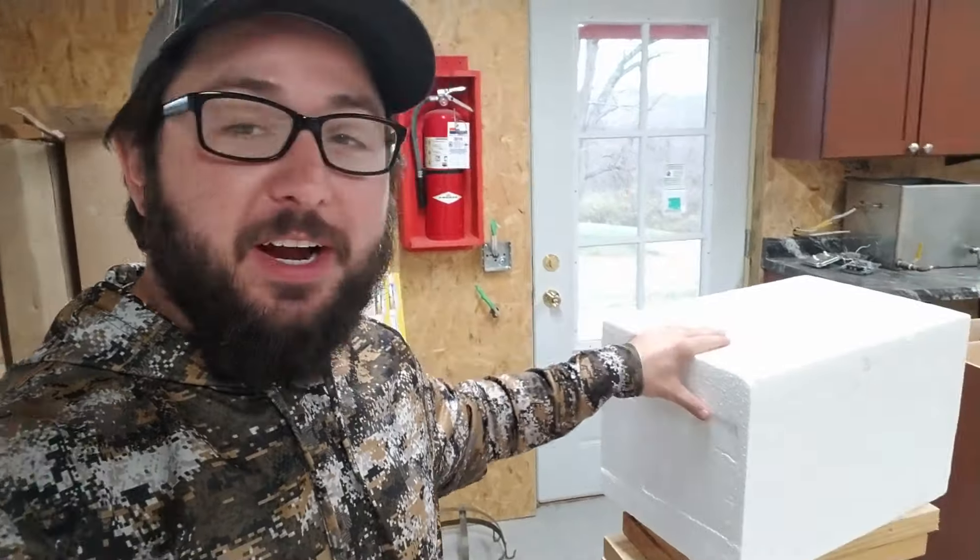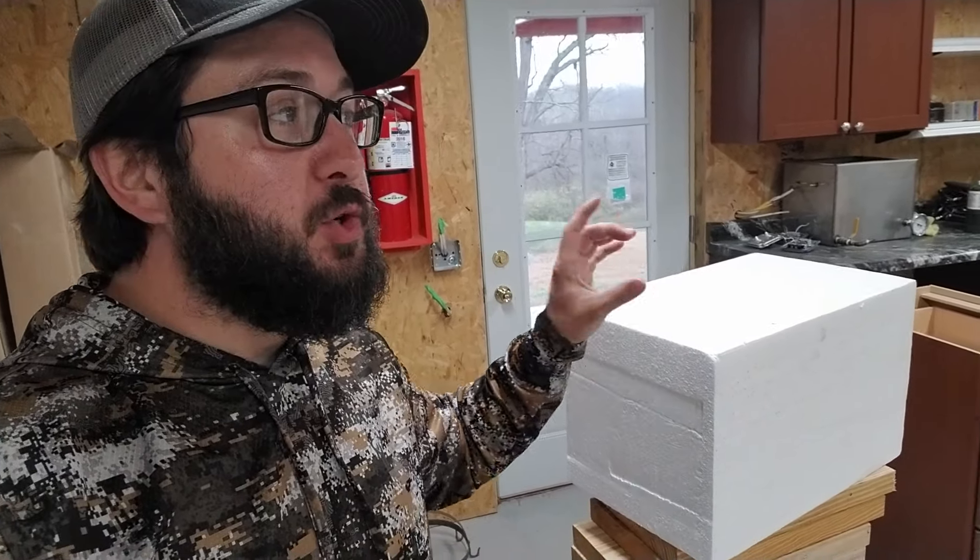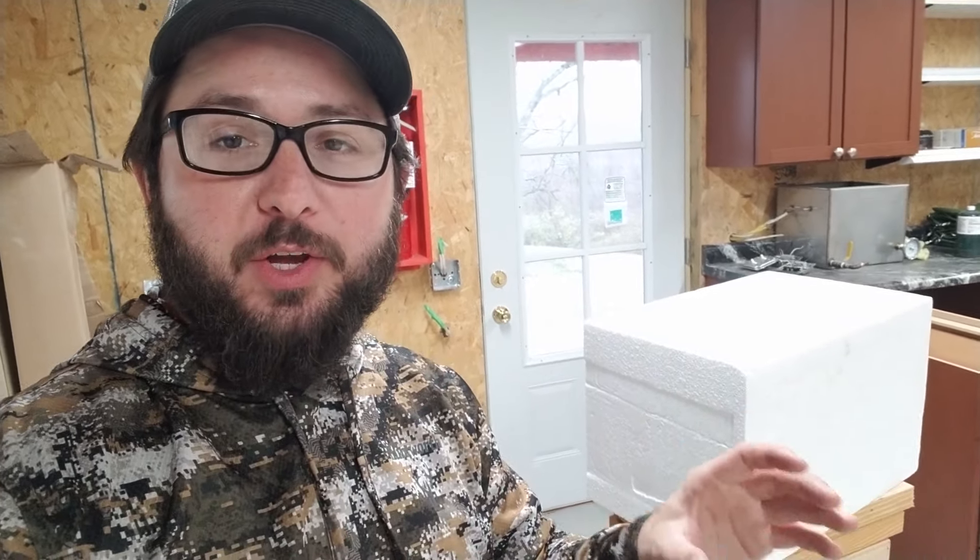There is not a better deal than free. I don't know if I've ever met anybody who has better luck than my dad at finding free stuff — it probably has a lot to do with the fact that he's always asking. He was able to find all of this styrofoam, which we're going to use as the first layer of insulation inside the cooler. Styrofoam has an R-value of four to five per inch, so inside the studs we'll have about three and a half inches — framed with two-by-fours — giving us somewhere between R-12 and R-15 with just our first layer of free styrofoam.